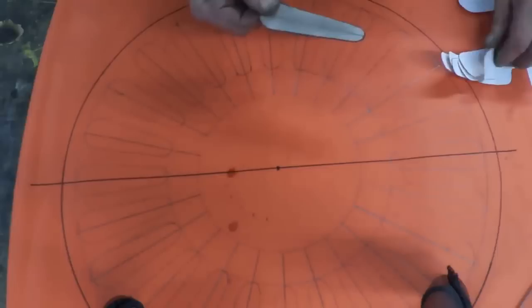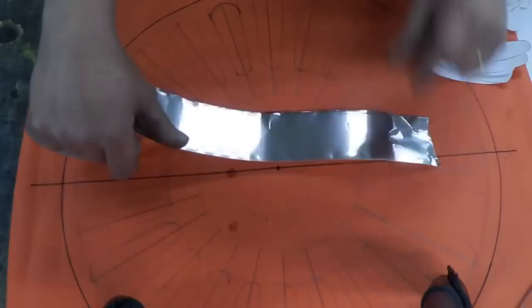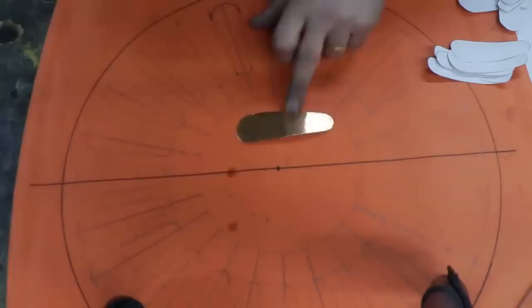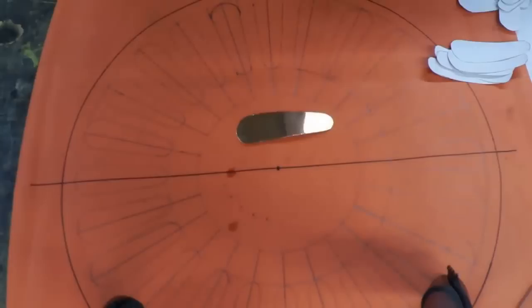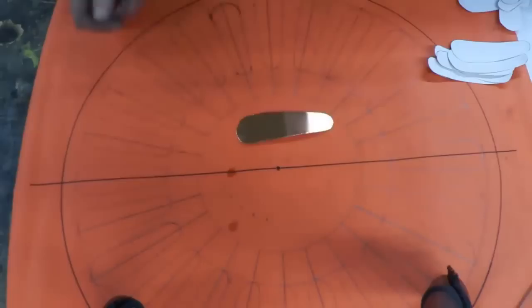I took that card template and put it on my metal foil. That's obviously copper — I like copper, it's a harder wearing metal though it does oxidize. The options you've got are really copper or aluminium. This aluminium tape is what's used for heating and ventilation — it comes pre-glued as a tape. If you use thicker aluminium tape you're going to need to glue it. The negative is it wears out a bit quicker, but the copper is a harder metal so it'll be longer wearing. The size and positioning of the sectors doesn't matter that much — it depends whether you're going for high voltage or high current. The metal you use isn't really that important: copper, tin, aluminium, whatever you can get stuck on there easily.